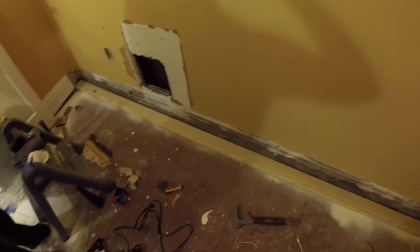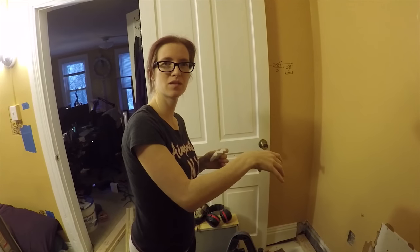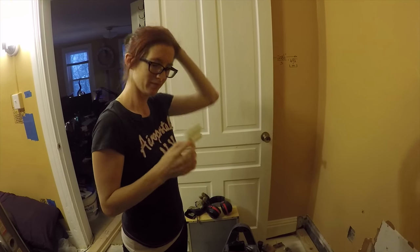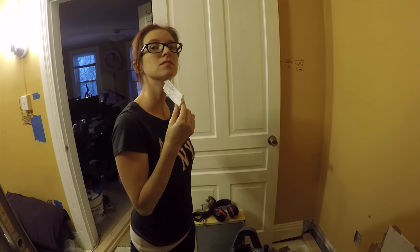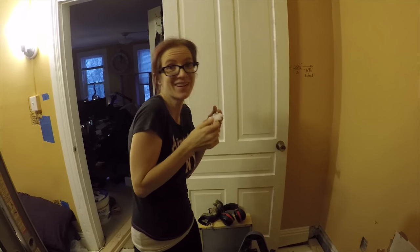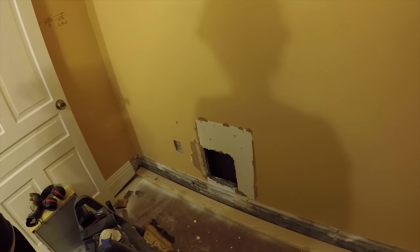So now you laid both boards. Wow. Yeah, this is the bottom plate. Oh, sweet. Okay, so how is that being attached? It's going to get screwed into the floor. Kind of like the tapcons that you did at the other house, but not nearly so aggressive. Right, you don't have to drill through. I can just drill into wood instead of concrete. I'm not sure if it'll hit a floor joist. Doesn't really matter either way because we do have hardwood floors, so I'll just screw it in at regular intervals. Okay. And that way it is firmly attached to the floor. You can attach it to the wall too, once I get the stud in place.